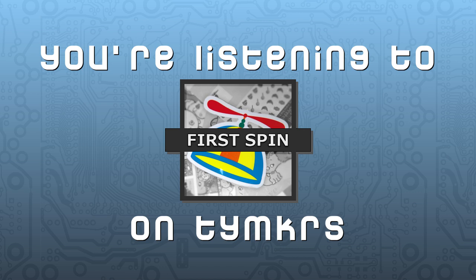For a basic understanding: the Sound Pal is a little piezo buzzer on a tiny board shaped like a small T, with headers that plug into a servo header. It can play notes and has preset sequences like Taps, Dixie, or La Cucaracha. With four lines of code and an object written by Phil Pilgrim in 2007, it's super easy to set up. You can change tempo and note duration.